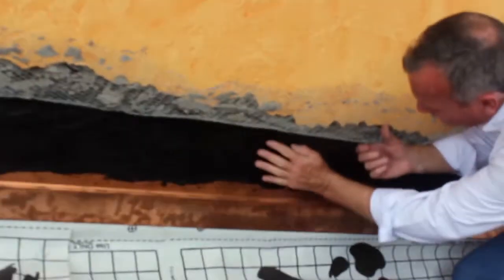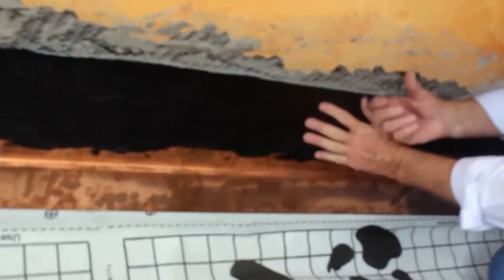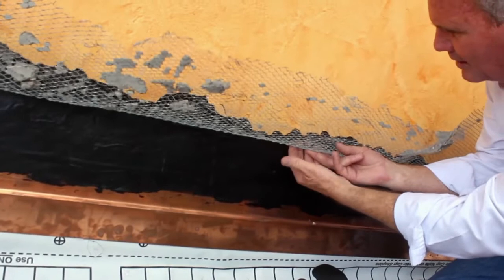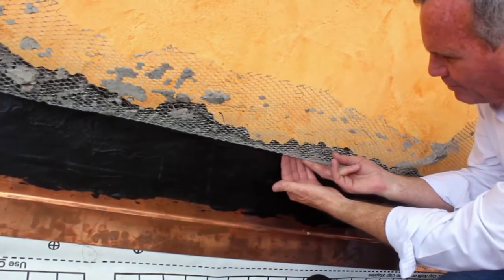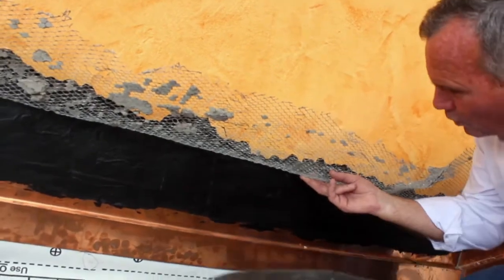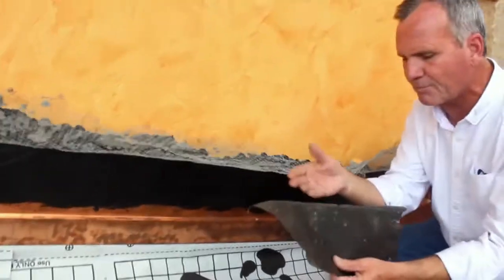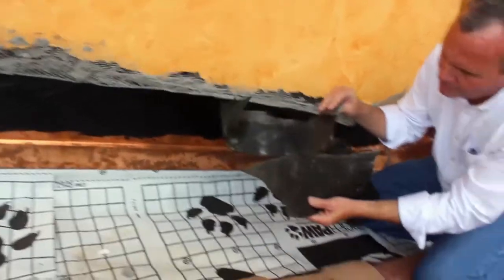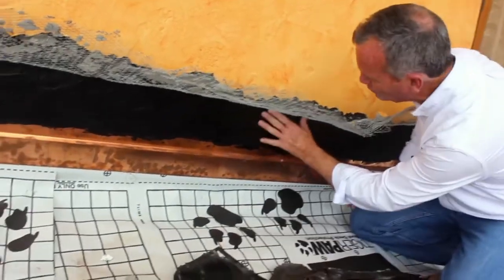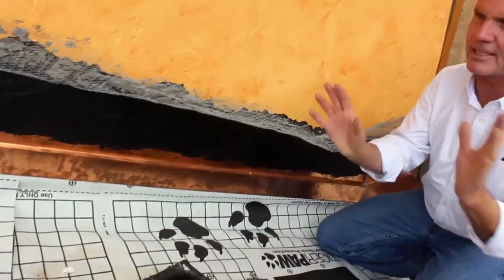And then we use a flashing adhesive mastic. And so this is actually made for that. You can see it's dry. It's like a sheet now. But what it enables us to do is pull out this stucco lath and use our putty knives to go up in there, sealing it to the one that was there before, so we don't have any kind of a break trying to tuck one behind the other like that, which is virtually impossible. So this is going to keep us so watertight that they'll never have leaks on this again.